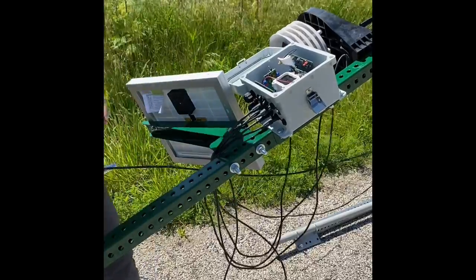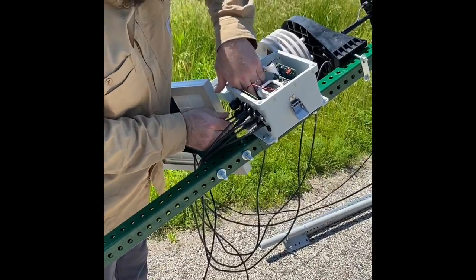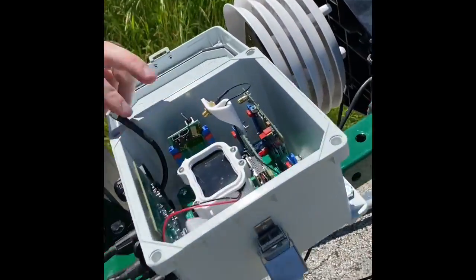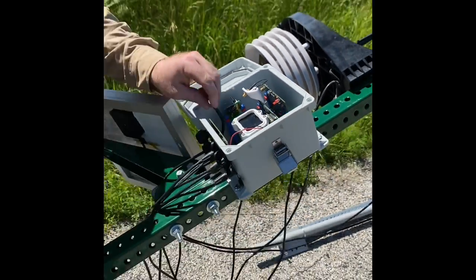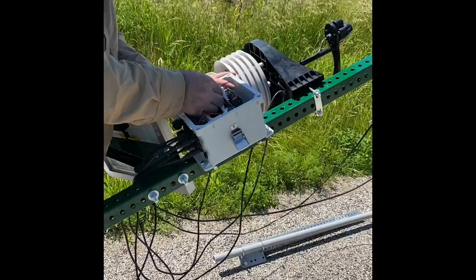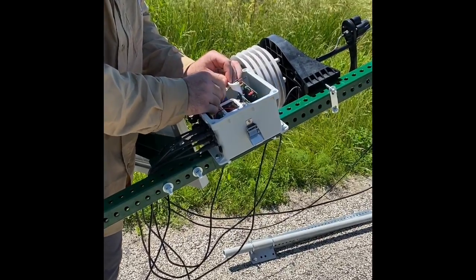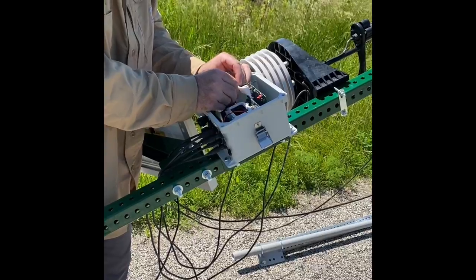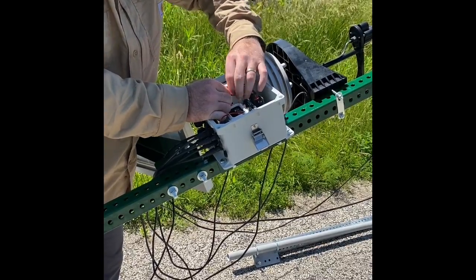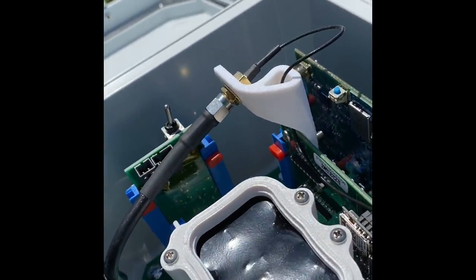And our cellular antenna coax cable. So our cellular antenna, which is the white antenna, will connect to the communications board, which also has a white mounting bracket for the cable port, the coax port. So you want to make sure when you're putting this coax cable in there that you're putting it on straight. It can be difficult at times to get it to be positioned correctly, and then once you get it, you'll see it screws on nice and easy, but you'll just hand tighten that down, and that's how you correctly install your cable coax.